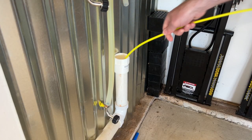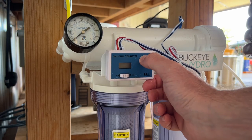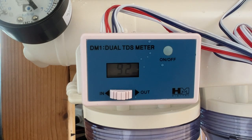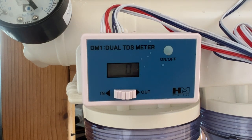With this meter I'll be able to monitor my RO water quality and eliminate any guesswork when replacing filters. Next I placed the outgoing hose into my drain pipe and then hooked up the water supply. Firing up the TDS meter for the first time indicated I have 92 solid parts per million going into the system. When I switched to see the output, the meter reads exactly what I was hoping for — zero.